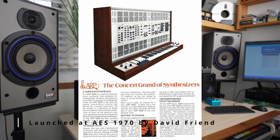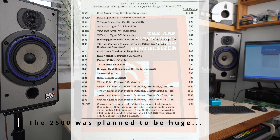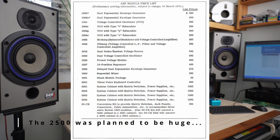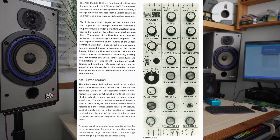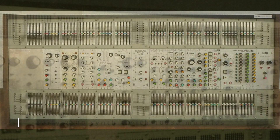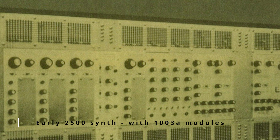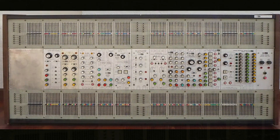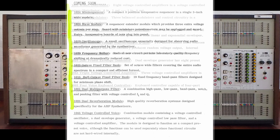By tracking down these documents, especially the various early versions, I have discovered what the full module release plan was for the ARP 2500 — and it will surprise you. The initial basic set of analog synth modules, like the VCO, VCF, envelope generators and VCAs, were complemented by more advanced designs we now recognize as the 1047 state variable filter, the 1045 synthesizer voice, and the 1036 dual sample and hold. The next set of modules would have expanded the 2500 even further, but were never manufactured. The full list of planned modules is revealed in the 1970 user manual and stands at an amazing total of 15.